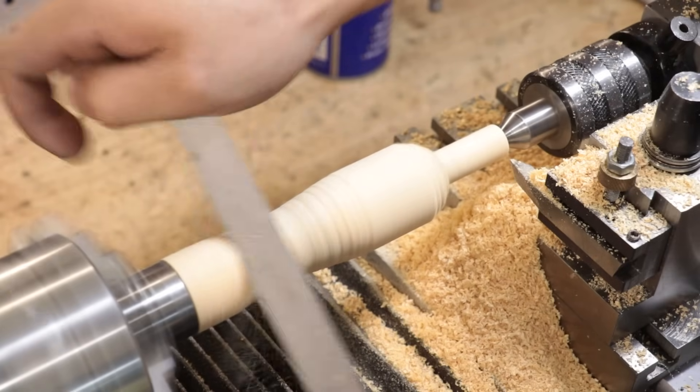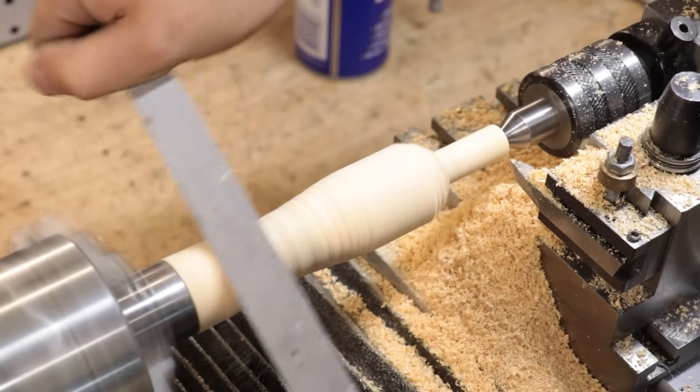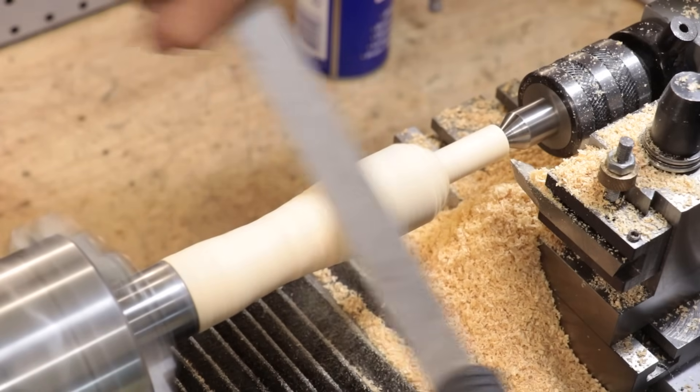The reason for that is twofold. The chucks just aren't really designed for holding wood - they bite in and leave pretty bad marks from where the jaws were. And it also doesn't help that the way a normal lathe works with hand wheels isn't really conducive to making long sweeping arcs like you'd want with most woodworking projects. You can try, but the results generally aren't going to be as good compared to using a proper wood turning setup.